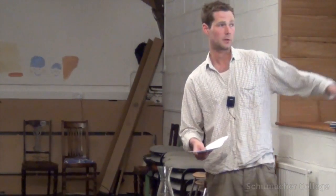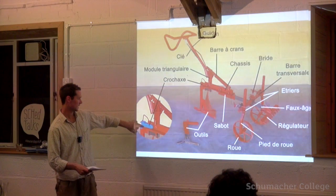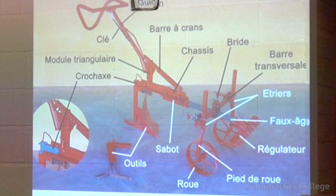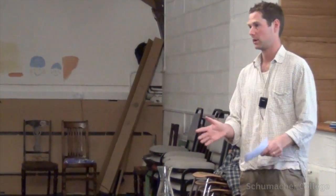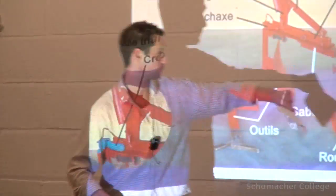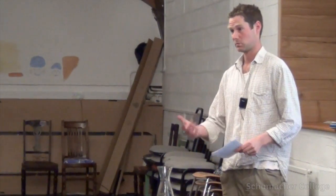Promata has modernised the Cassine using a lightweight aluminium frame and modern tillage tools. It's a toolbar carrier — you can fit up to seven or eight different attachments onto it. In terms of a commercial market garden, this saves time because a lot of time working with horses is spent changing implements. Previously, every time you wanted to go from a plough to a harrow, to discs, or to an inter-row cultivator, you'd have to unharness the horses and put a new tool on. With the Cassine, you can leave the horse attached to the regulator at the front and simply unhook the tool from the back and slot in a new one.